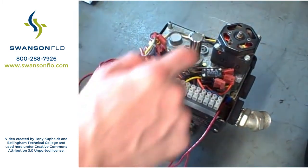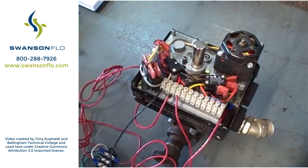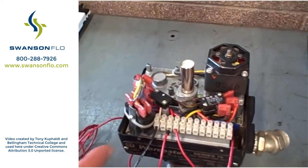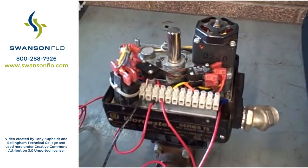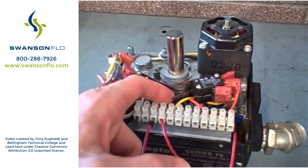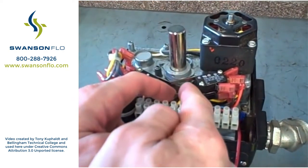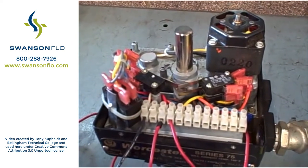If it weren't for that, the valve would just keep on rotating — going open and close, being a ball valve style. So I want to demonstrate very quickly how these limit switches work. I'm going to go back to the open position here. I'm going to force it to stop. You can see I've forced the valve to stop by triggering the limit switch. When the cam comes around, it will do that automatically on its own, and that is what forces the valve to stop moving.